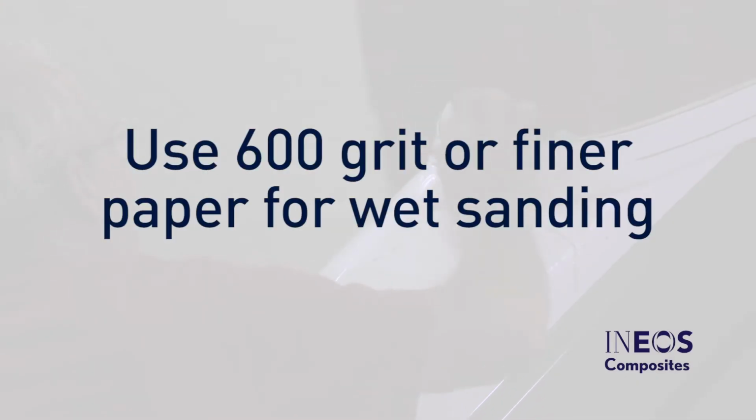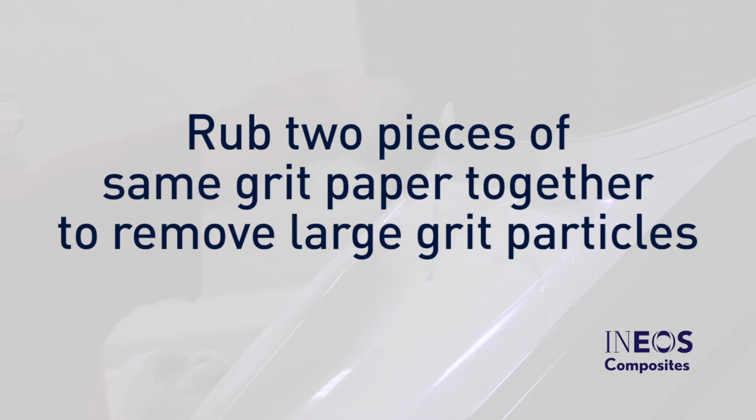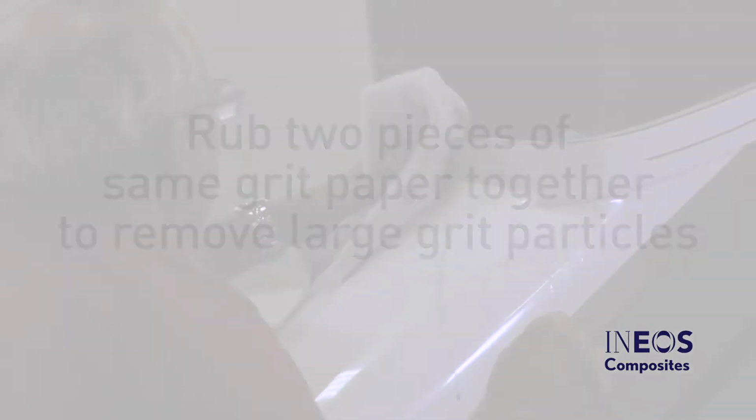Wet sanding techniques are used with grits of 600 or finer to achieve a smoother surface prior to buffing. Rubbing two pieces of sandpaper together with the same grit size will remove any oversized grit particles. This is a very old practice that works effectively to prevent random scratches in the film surface.